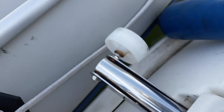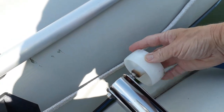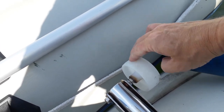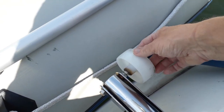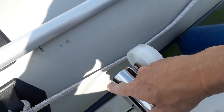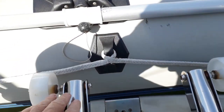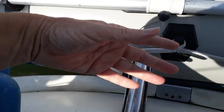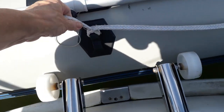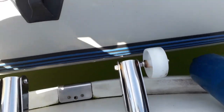Another little adaptation that we've put in — and I know some people have seen them — is what I call the training wheels, because they remind me of the things that kids get on their bikes when they're learning to ride bicycles. These are just nylon wheels; they don't have to be any particular thing. We've taken a 10 or 12 centimetre length of studded stainless steel rod and used nylock bolts to mount this through the swim ladder. This means that when we're lifting the dinghy up, it can ride over the swim ladder without touching it or any of its bolts.